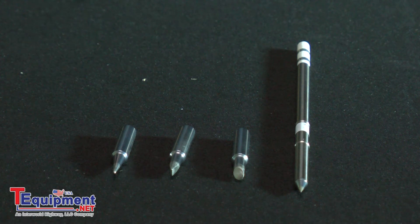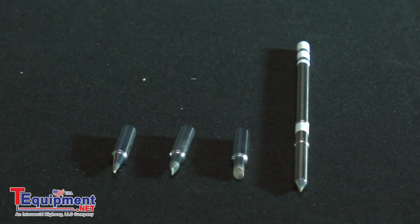The soldering tip is very important. Think of a soldering tip as a reservoir — the bigger the reservoir, the more heat you have to transfer. Also, the heat transfer is dependent on the surface contact area between the tip and the metal parts being soldered. So you want to increase that surface contact area as much as possible, and the shape of the tips allows for that surface contact increase.